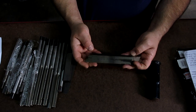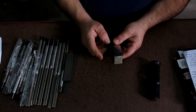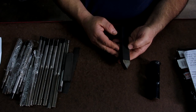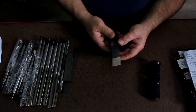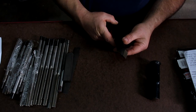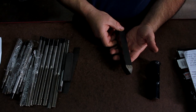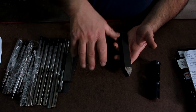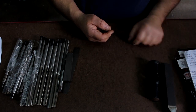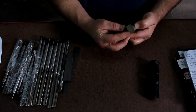Now that's a big tool bit — it's Victor Cobalt and it looks like it's ground as a threader. I've ground enough high-speed tools to tell you that grinding that much material off takes a while. That's kind of an A-bomb size tool — one inch, 25 millimeter. I think Adam's multifix holder will take up to that size tool, so Adam, that might be headed out to Florida for you. Whoever did all that grinding did a nice job — you could probably use this as is, just needs a little flat.